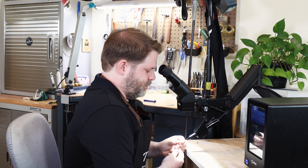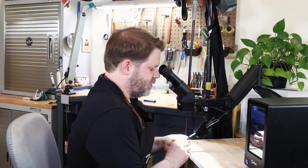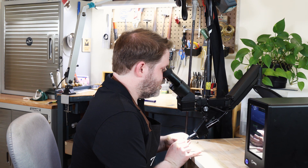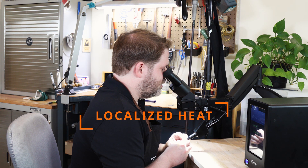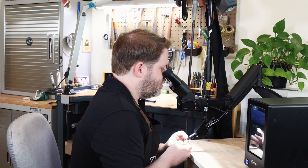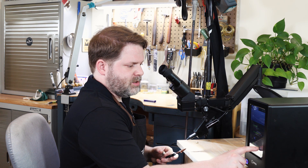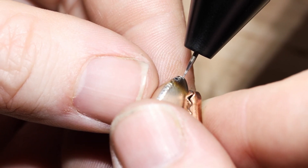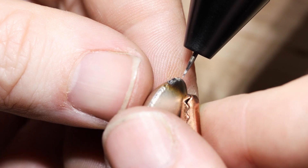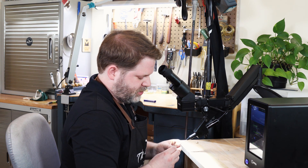I'm going to take my ground. It's a little bit hard to clip around this, but I can just hold the ground on the surface to close the circuit of the weld and bring this up. Because the heat is so localized, I can have my finger right next to the weld spot to make sure it is holding just in place. I can actually bring up the number of welds I do per second, so I can go through and do this a little bit faster. As you can see, my hands are very close to the weld spot, and it's just fine.